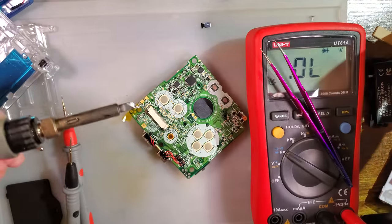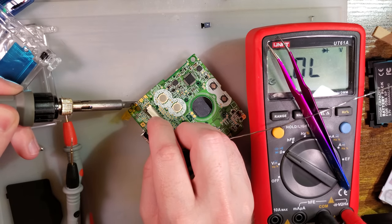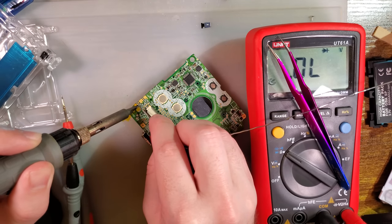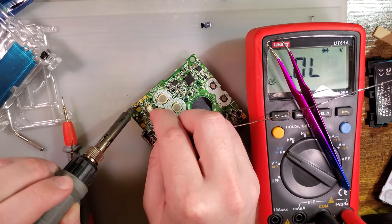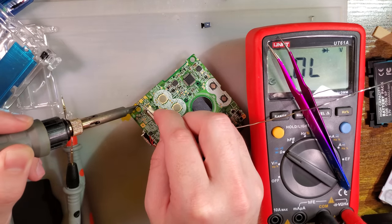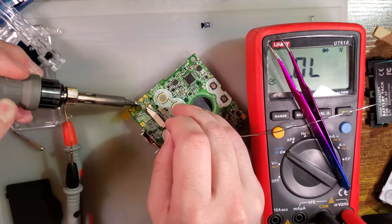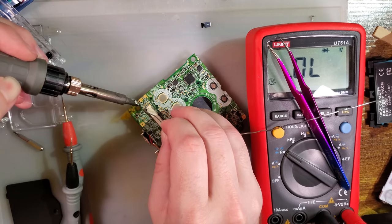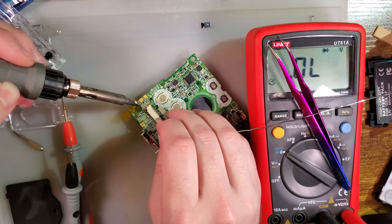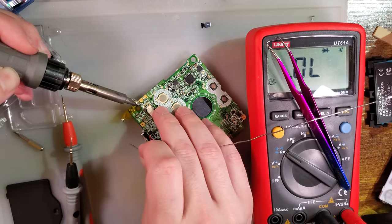Now I'm going to remove it, take my soldering iron, and hit both sides with solder, because of the nice juicy leaded solder. If you hit both sides and keep going back and forth fast enough, you might be able to desolder it that way. But an even easier way is to just use a big old solder ball that'll hit both sides, and then you can just wipe it off. Problem is, that'll destroy the LED, but in this case, we don't really care about that, do we?